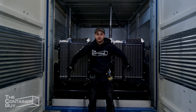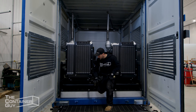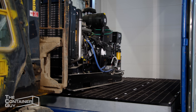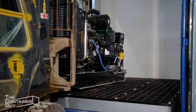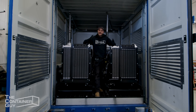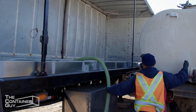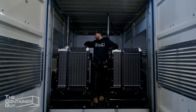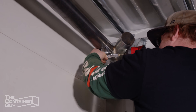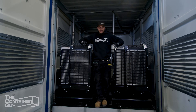In here are the two generators. We have used our hazardous material containment cans to sit underneath these things, so if ever there was antifreeze or oil that spilled out, the ground is protected — and that's super important. We do a ton of hazardous material storage modifications here at the Container Guy. It was really fun to do this mod because we were able to play around with things new to us, like installing exhaust pipes and having them exit out of the shipping container.